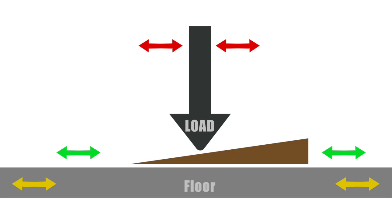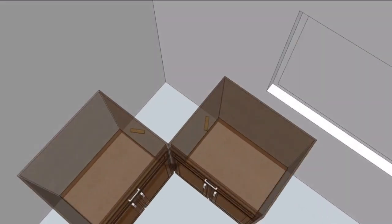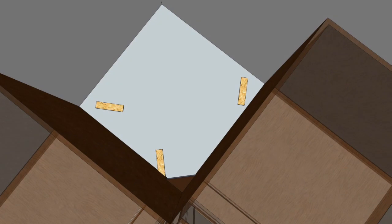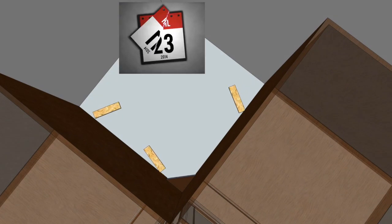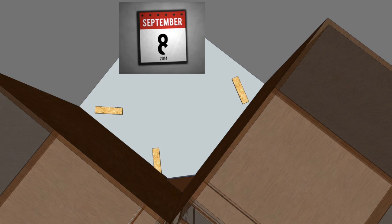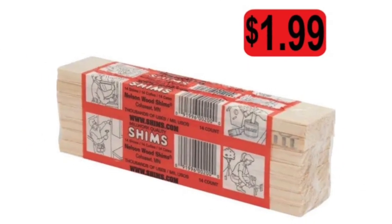Simple physics dictates that you can't put a load on a wedge and expect it to remain load bearing for more than about 24 hours. Anyone who has ever installed kitchen cabinets knows that if you pull off the old countertops and look down at the old shims — where are they? They're not tucked in nice and neat under the cabinets. They walked away years ago through expansion and contraction. This process started the day of the install, and if we come back a year from now, those shims will be in a completely different location. So the idea of using little wooden wedges to support brand new cabinets and granite for the next 10 or 15 years, just because they're cheap, does not make sense.